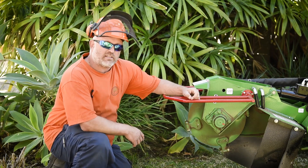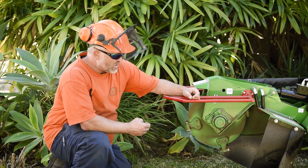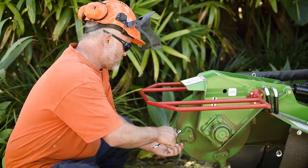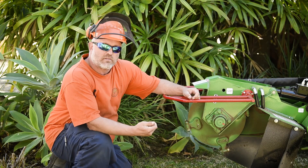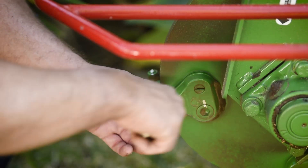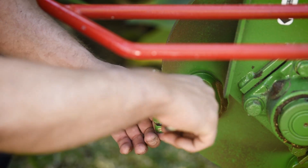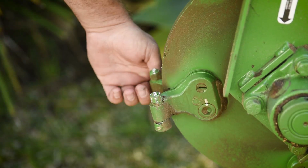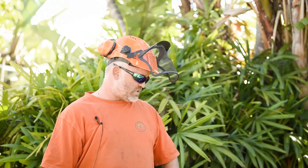This machine only has eight cutting teeth, using the 900 series Green Teeth. You can get three turns out of those — if you hit a bit of sandstone or something on site, it's easy to quickly loosen them off and spin the tooth to get a sharp edge again. Having eight teeth is really beneficial for maintenance and cost-effectiveness. I've also been told that if the motor bogs down, it recovers a lot faster because the cutter wheel is much lighter than the traditional 18-tooth setup.